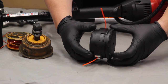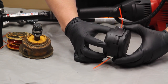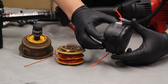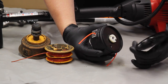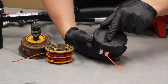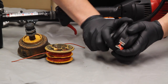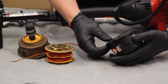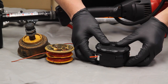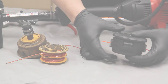This is by Shakespeare — I found this at Lowe's when I went to pick up the replacement string trimmer head. This is a little bit different. It doesn't hold as much line, but it makes it extremely easy to replace. With this piece right here, when you line up the arrows with the holes, you actually feed the line right into the head and simply crank it until the line is completely pulled in. Then it works like any other bump head where you hit it on the ground, and you can see it has a spring that allows the string to release out. So it makes it a lot easier.